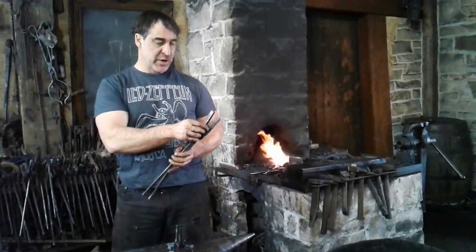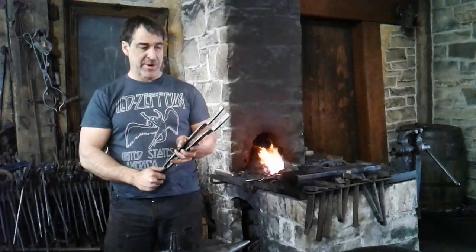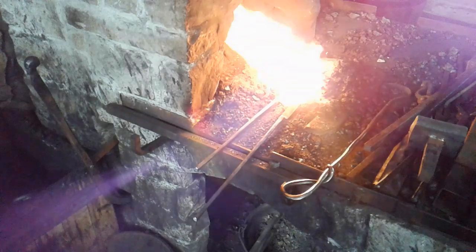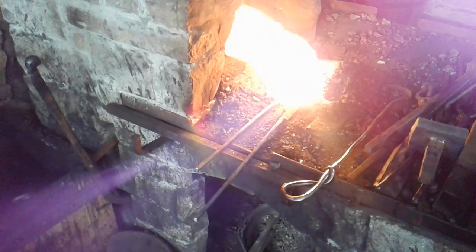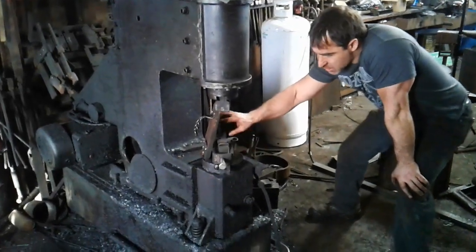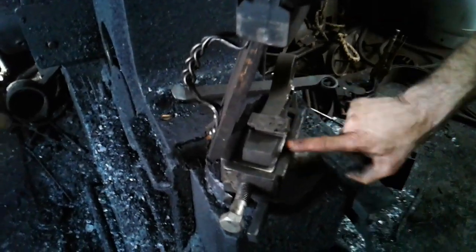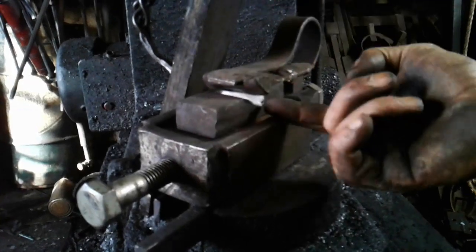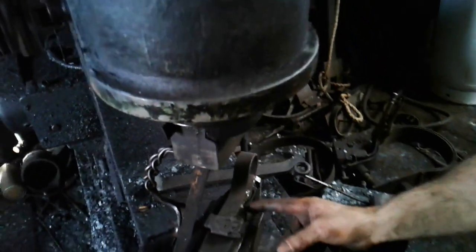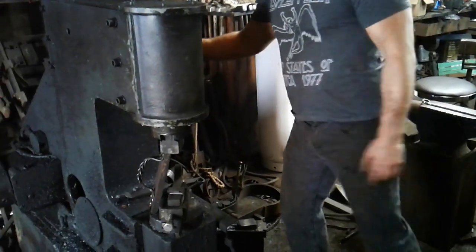Our third pair of tongs is v-bit tongs. I've got a jig for my power hammer, so I'm going to heat these up and bend the V into them using the power hammer die — a very quick and effective method. The jig has a triangular shape that sits above on a spring and a triangular valley below, and the steel goes in between. When it hits down it forms a nice sharp V. You could also make this sort of thing for a hand hammer on an anvil — exactly the same configuration.